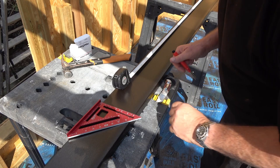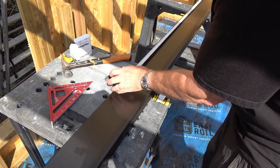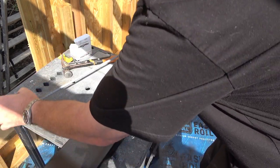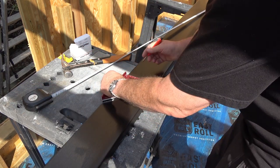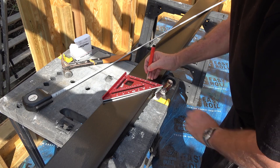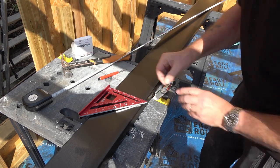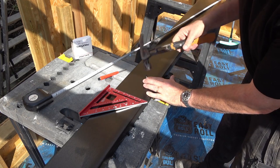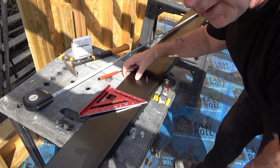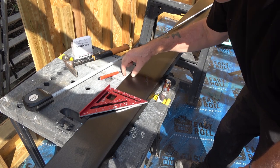The method I'm using is: mark 100mm from the end, then mark every 500mm. This is an American Milwaukee tape so it reads in inches, but there's a little circle mark on it. That's where we'll go along with our nails. At the top we've got the trim that holds the rubber roof down which folds round onto the top, so that'll be secure with screws too.